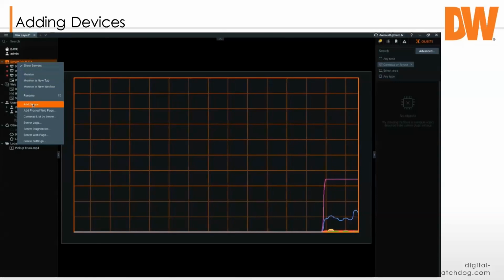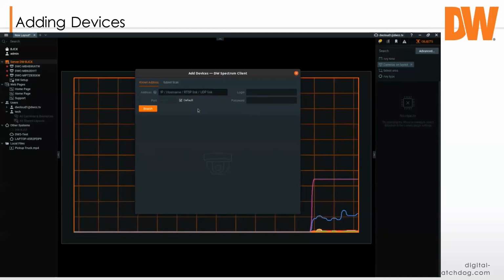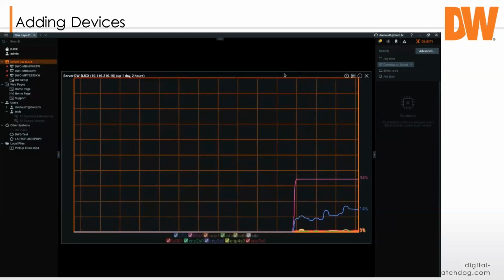So you can also add devices to the system. So let's say you've got a camera on a DSL line somewhere. As long as you know the IP, the ports are open, the username and password, you can have the system connect to it. So this would be going over the LAN port, the internet port, and we can go in and do it. It's also things that might be across a VPN. You know, you can ping and things like that. So a very good setup for adding another camera that might be somewhere else that's not available to plug into the PoE switch on the back.